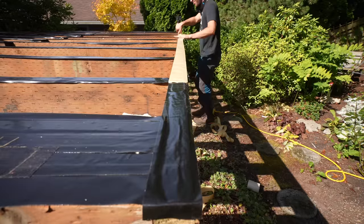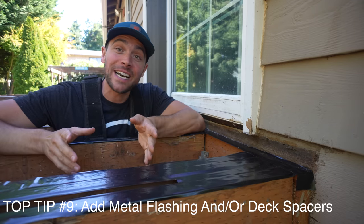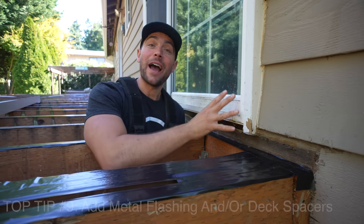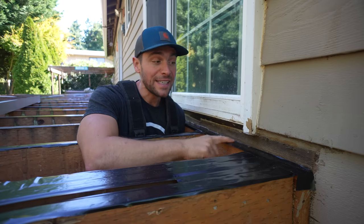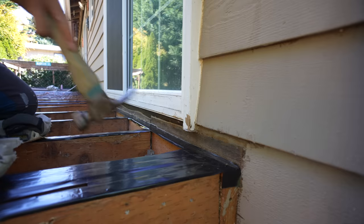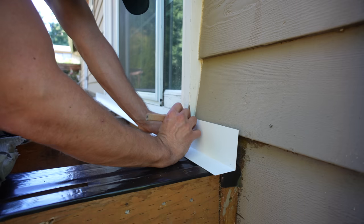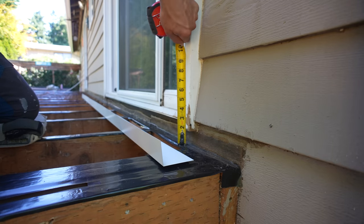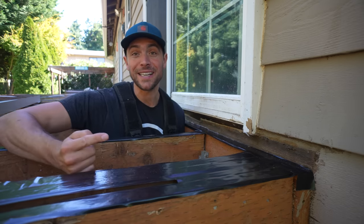With all flashing tape attached to our joists, we get to metal flashing — tip number nine. Flashing is one of the most important elements of any deck project, whether new build or remodel. We want to guarantee proper protection of our house and not jeopardize its longevity with the deck. On this project, the ledger board was attached directly to siding — a no-no. We need some type of barrier between them. Fortunately the eaves above direct water away, so there's very little damage here, but we will put flashing going up underneath the siding so any moisture hitting the deck gets propelled away from the house.